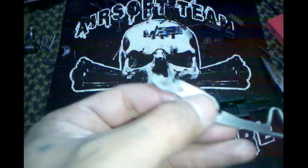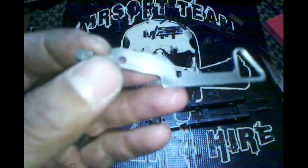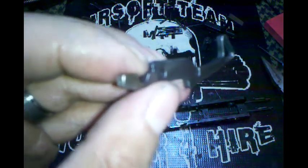I don't know if you can see the heat marks in here where I heated it up right here, from here to here. But basically, when I pulled that trigger and I didn't release that full auto sear, it bent the front of this downward. So this part here, from here to here, bent this way in that direction. So I had to heat this up, bend it back, and then now that 2-round burst problem that I was having, that it would shoot upon releasing the trigger after a 2-round cycle, that corrected that problem, and that was the failure here.